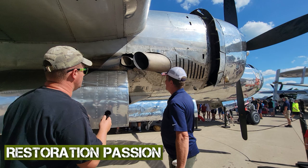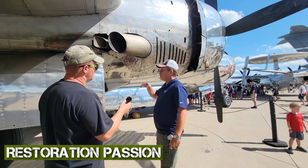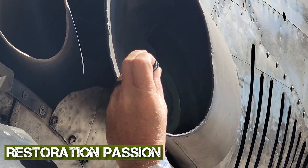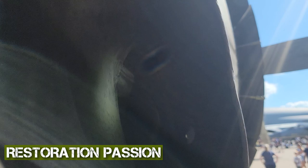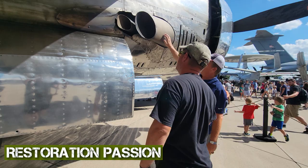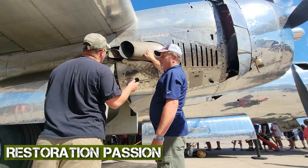So the turbo's just, the spools got it out of it, or no, there isn't anything. Oh, so on Fifi, we still fly with the housings, and these still function with exhaust. On Doc, we don't do that. Can you see the through pipe through there? Oh, wow. Did you get a shot of that? Let me do another one. They rerouted the exhaust through the turbo. It just completely bypasses everything, and everything comes out what would have been the wastegate now. That's why Fifi and Doc sound a little different even though they're the same engines. But I don't have to deal with these things cracking and trying to find somebody on the road that can weld brittle old metal.